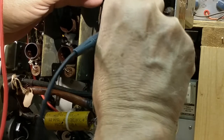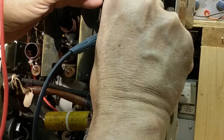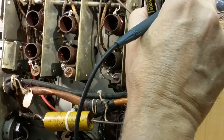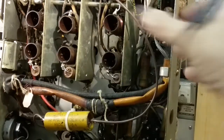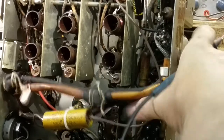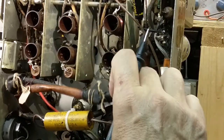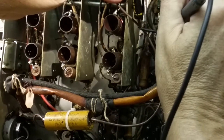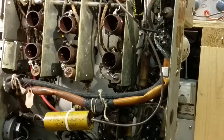There's the 50, the body green. I'm so used to carbon resistors. 53K, and that's what it is. Green, black, and orange to be 50K. All right. Now we are down past this area here. I don't see anything else. So we have this resistor that was put in. We can check it for a short. No, it's fine.